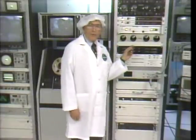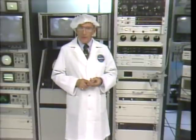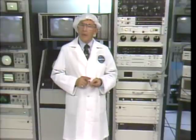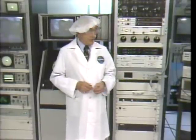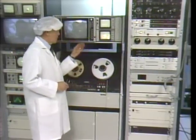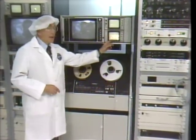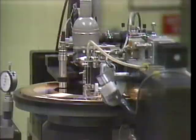This control board tracks the program audio response. Now, if a little sweetening is required, it can be done right here. Stereo, noise reduction, and dual soundtrack or bilingual audio is also processed through this control unit. Now, program video is also monitored at all times, both visually and electronically. The master cutting has now started.